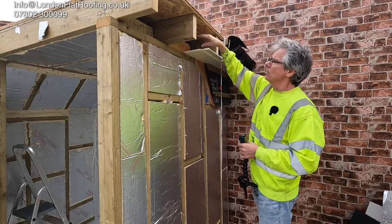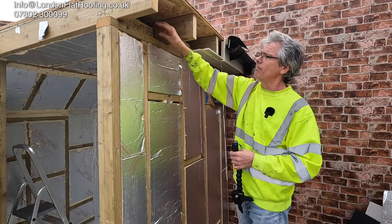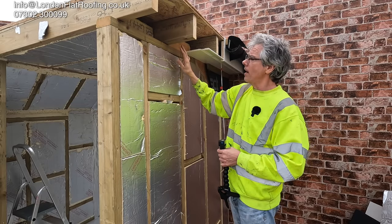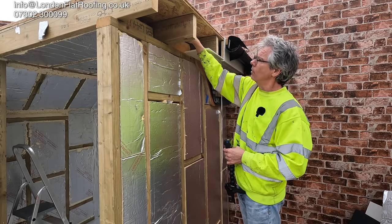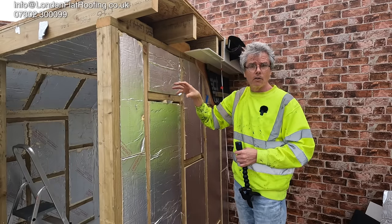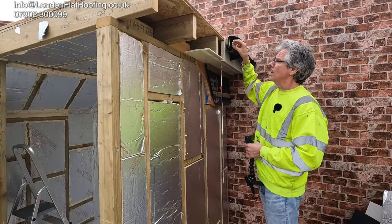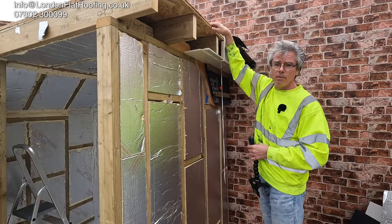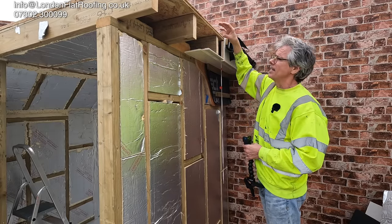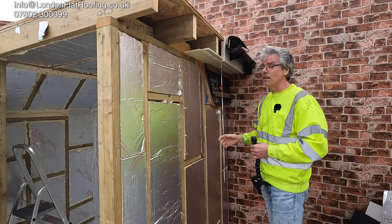Take no notice of the shadow. You'll see inside here a massive amount of heat loss over the top and around that area. And because I kept this one back on purpose to show you why this should be extended forward — right out to the edge to continue that thermal element of the cold roof right the way around to the wall — you'll just see the amount of heat loss which is coming from there. We'll look down on top and you'll see the heat loss coming through. That heat loss which you'll see from the top — which is bare at the moment, just bare OSB — the heat loss is coming through into the vented space and it's heating the space which is 50mm above it. Massive amount of heat loss. And of course with the cost of energy today, you just don't want that.